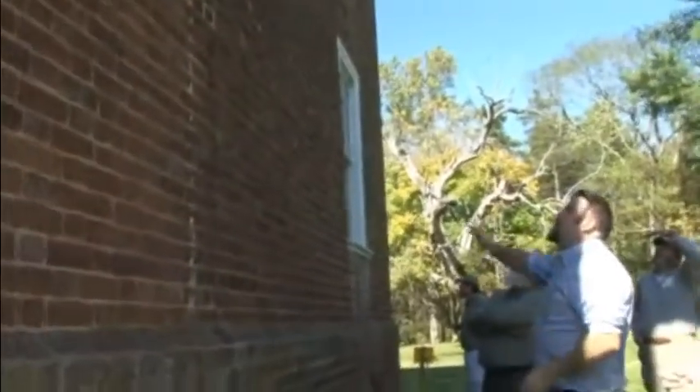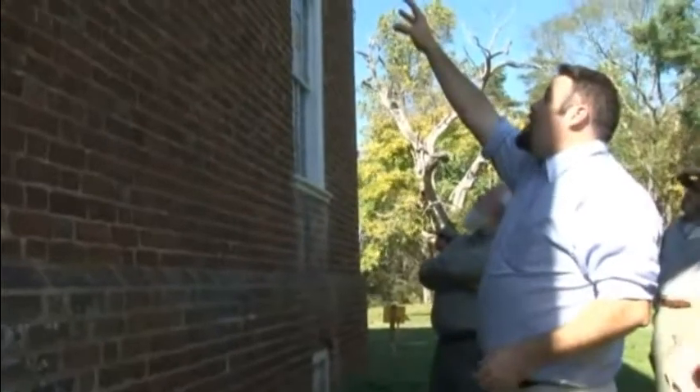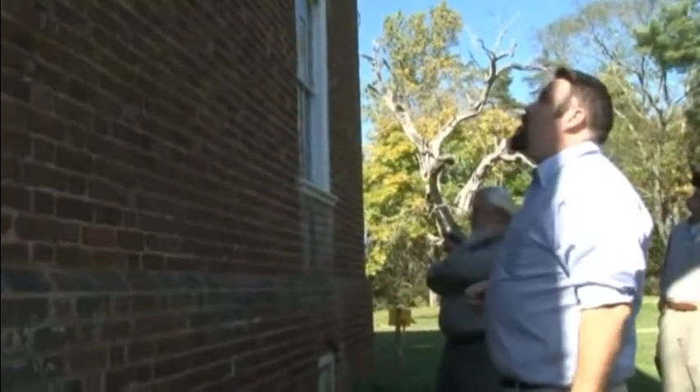It has. And one thing that you can notice as well is a distinct discoloration where this work has been repointed in the past, and it is holding moisture coming from the side of that window extending down. That work is really holding moisture, and of course it's concentrated right there in the center where that work has been redone.